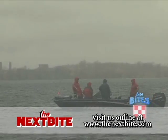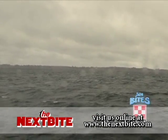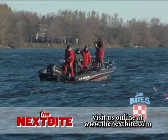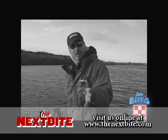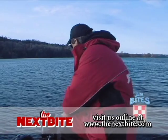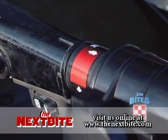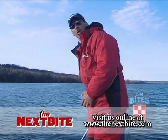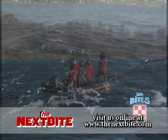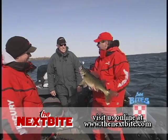Here's another good scenario. Even in open water situations where we're fishing flats areas — you saw how big that fish was — if this was a rough day, the wind could be pushing me so fast that I couldn't actually slow the boat down enough. I'd be putting way too much pressure on that fish. With the tiller kicker, I can kick this engine in neutral, then reverse depending on what speed I need and the size of the fish. I can actually get on the back deck, run the kicker in reverse, maneuver the boat wherever I have to, to kick that fish off into an area that's easier to net or to reduce the amount of pressure on the fish.